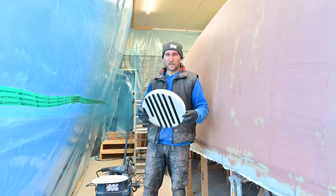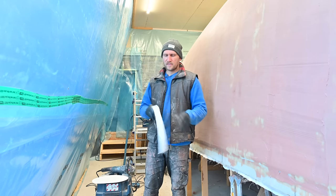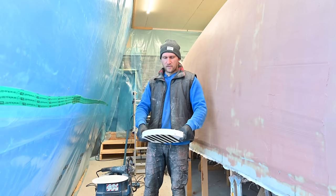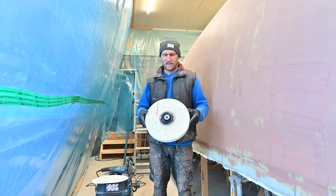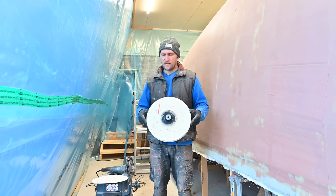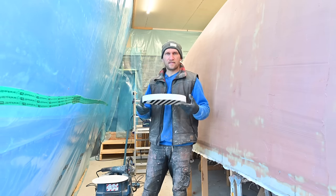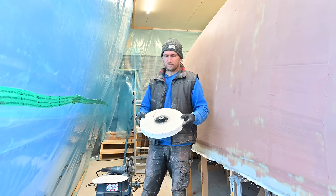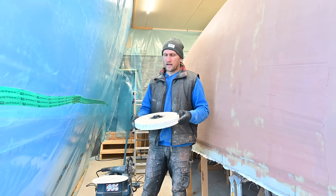It's so cool when you make these sandwich panels, because this core is pretty thick, and that makes it really rigid and non-flexible, really strong. And that's the whole theory behind using a sandwich material. You can have a really light panel that is still very stiff and strong. So I hope this will work okay.